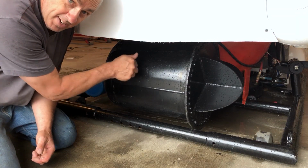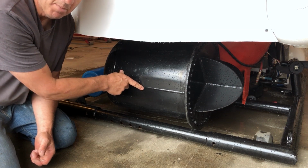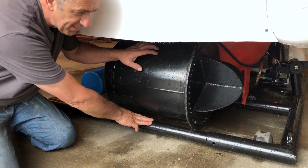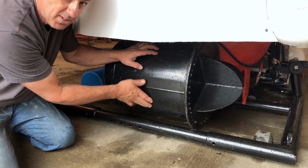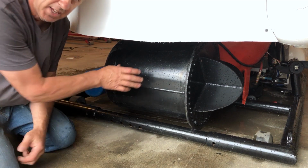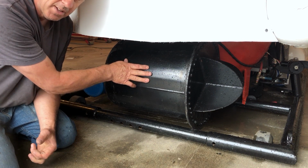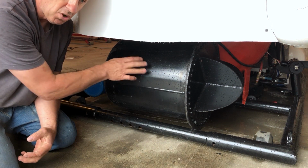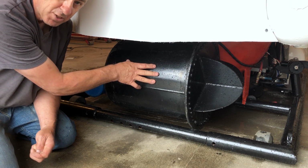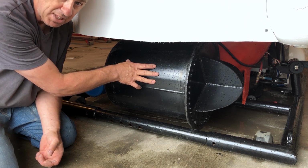So this guy right here, this is my battery pod. It stays with the Submarine when the chassis is jettisoned. I need the weight on the bottom to keep the sub upright when the chassis is jettisoned. It holds 2 golf cart AGM batteries, so no need for venting or anything like that. It's a minimal amount of batteries, but in my experience, it's actually plenty.